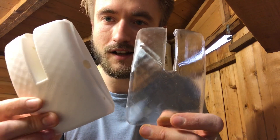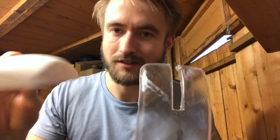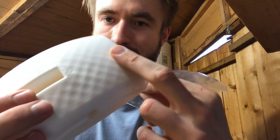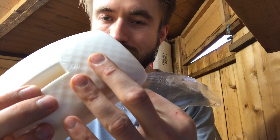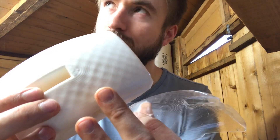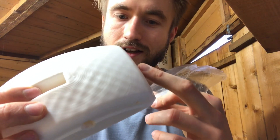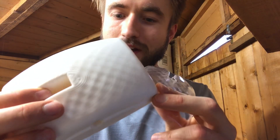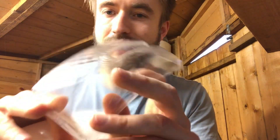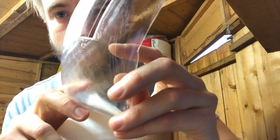A couple of things to note from the 3D print. I was a bit apprehensive about whether this would work or whether it would just go all melty — and it didn't do too bad, but it has gone a bit melty. You can see those dimples on there; these are from the top layer of the 3D printed part warping and getting hot and going wobbly. Those dimples are the impression of the infill material which is filled inside this part. I gave the outside 2mm of thickness, thinking that's probably as much as I want without turning this into a full brick. You can see the dimples copied across, and obviously the layers of the 3D print have come out in the vacuum form — it really takes the impression of all the tiny features as well.